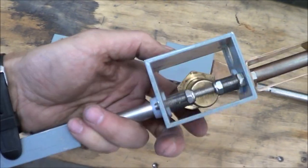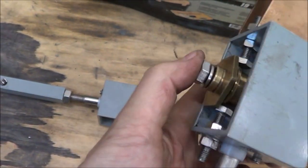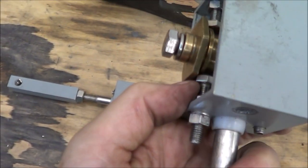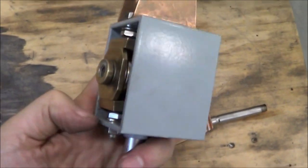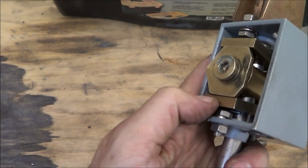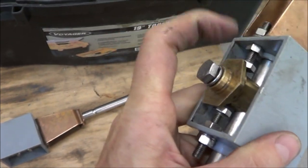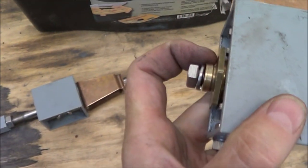So what is it really? Well, a difference is that with these bolts like this, the contact point for this guy that actually moves the bucket lever is down here a little way. So it's contacting down there. And when the lockers are present, the contact point is up here just a little higher. So what that implies is there's actually slightly more rotational torque on the slider bar, transmitted through this brass piece, when there's a force of resistance on the brake bucket.